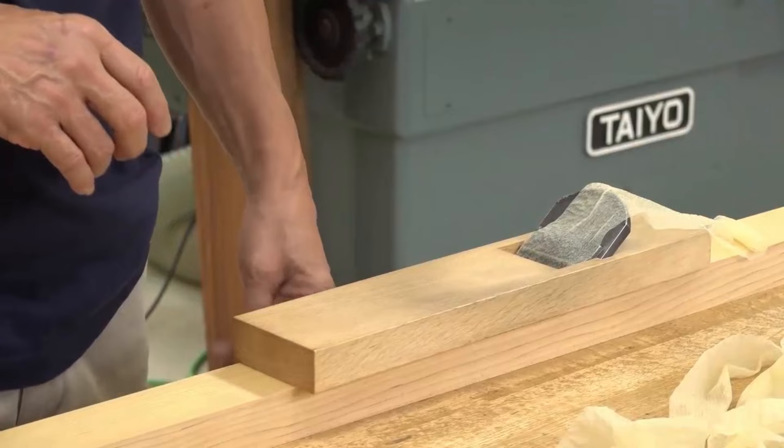It becomes noisy when you plane against the grain direction. You can get tear out — a situation in which the wood grain tears ahead of the plane blade, leaving the surface rough and gouged — and it will start to make coarse, abrasive sounds. So when I feel the surface become coarse and abrasive, I slow down and plane very slowly. I can minimize tear out simply by reducing my speed.